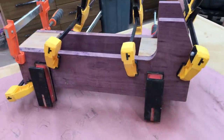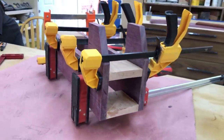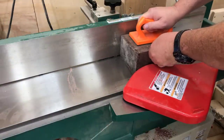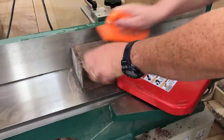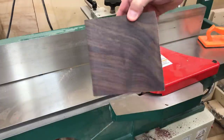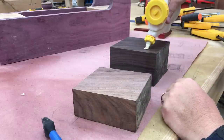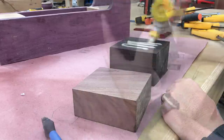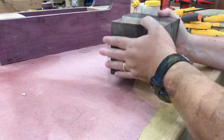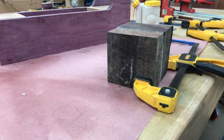And here is a good preliminary view of the dynamic body and jaw. I thought something that might add a lot of nice character would be to fill the gap between those sides of the jaw with something beautiful like East Indian rosewood — and that's what I'm planing down and joining up here. I'm going to orient it in such a way in the jaw so that the end grain is facing the clamping surface. This will give us maximum strength.